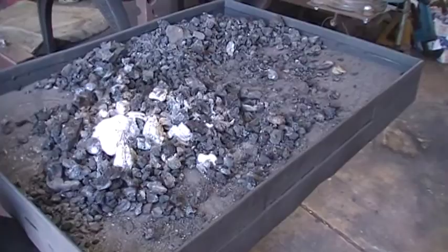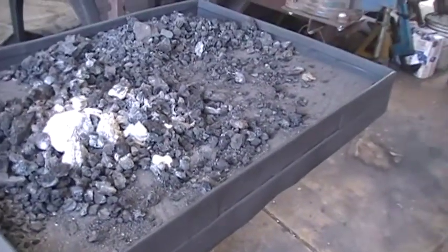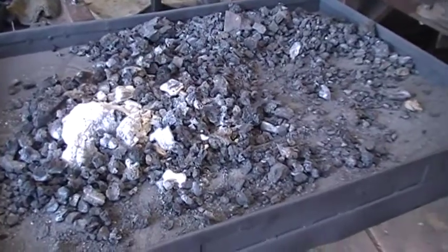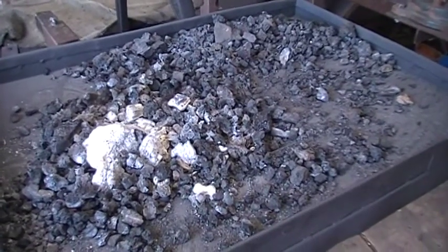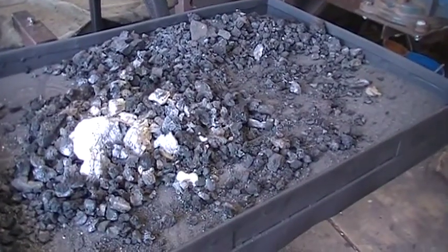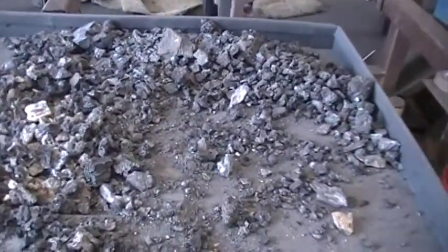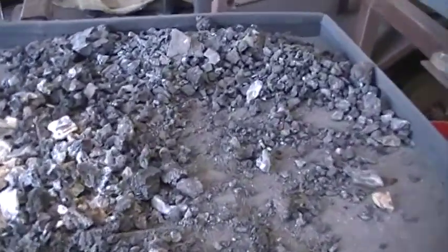I did build my fire — I started my fire with a bed of charcoal. The bigger firebox allows that. So I built a pretty good size of charcoal down in the bottom and definitely just started that up. That will start real easily. I just put a little bit of paper in the bottom and let it turn the crank — she starts right up. Then I just started pushing the coals. Now this is already once-burnt coal, which is to say a lot of it is coked up already, which is going to help a lot in heating.